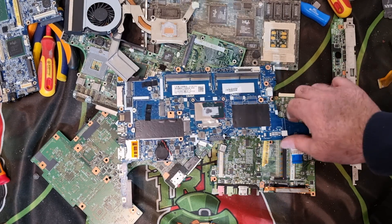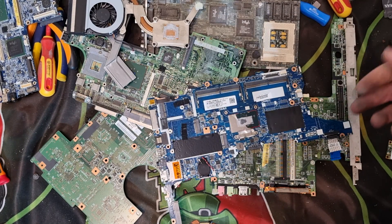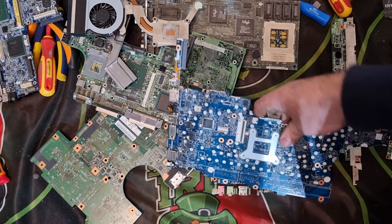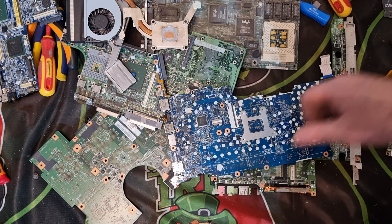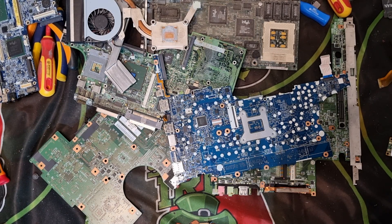That's just a little bit of what I look for on the boards. Not everyone will go into the same detail — some cherry pick, some just take off the gold corner BGAs, some add the IC chips, some go into MLCCs. I clean the board completely, then put everything into jars to be refined later and the bare board goes into the recycling bin. Thanks for watching — and David Young, I hope that helped answer what's worthwhile taking off laptops. If you're in America, maybe just sell them whole to Board Sort. Catch you on the next one.